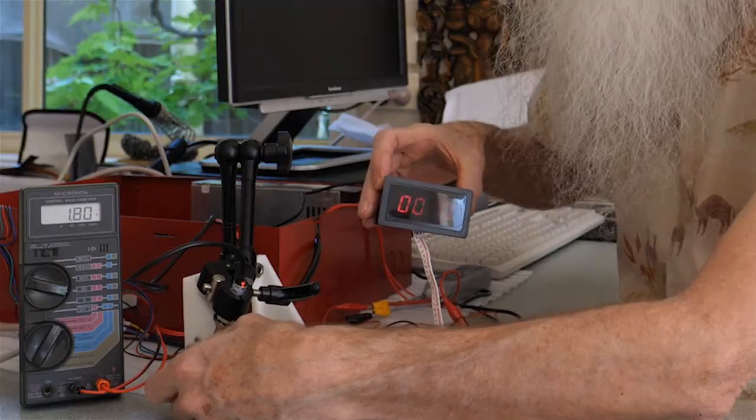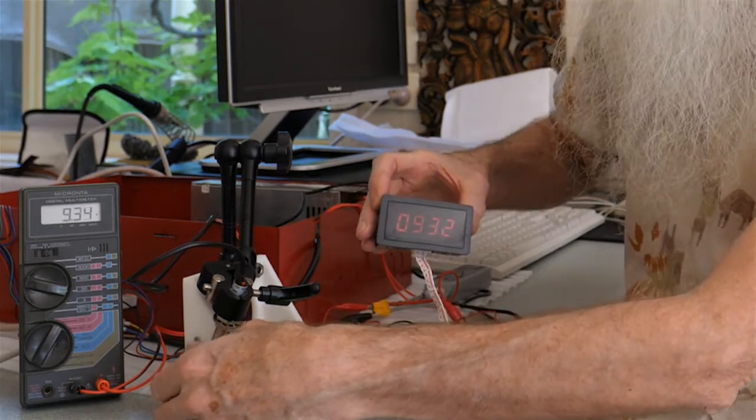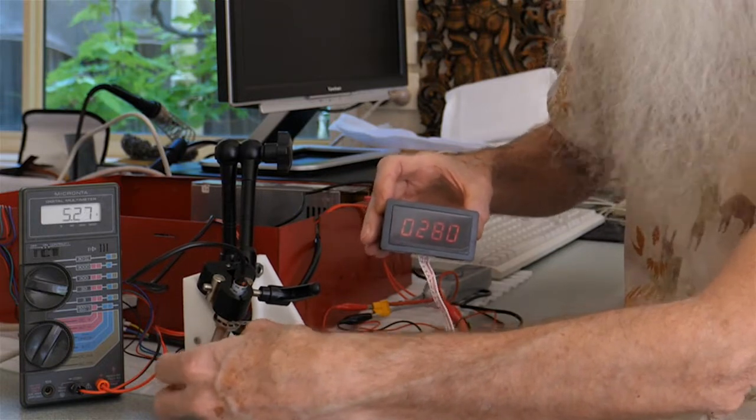When we come around it drops down to 1.8. Now if you're running a 5-volt system, 1.8 volts might be on all the time. So you may need to power your meter separately. This is the benefit of doing the test — you could have said, great, it runs perfect, gone out, put it on the machine, drilled all your holes, cut all your wires, put your meter in, wired it all up, and all of a sudden your buzzer's on all the time. What's going on, what have I done wrong? These are some of the traps.